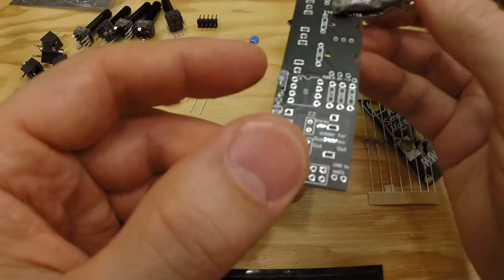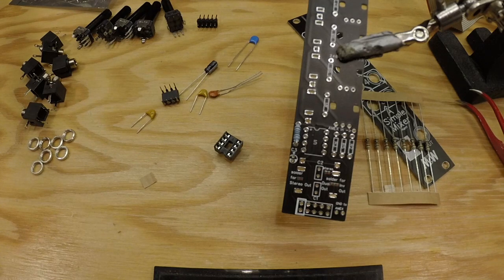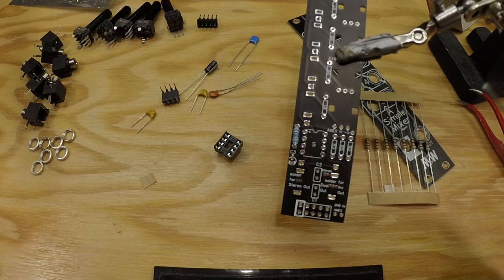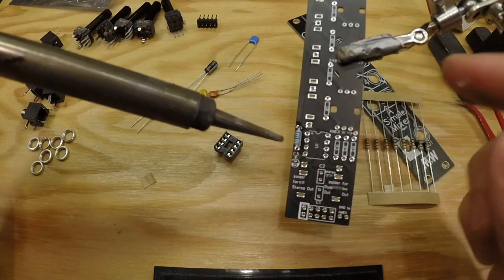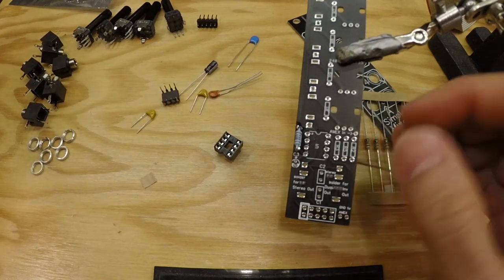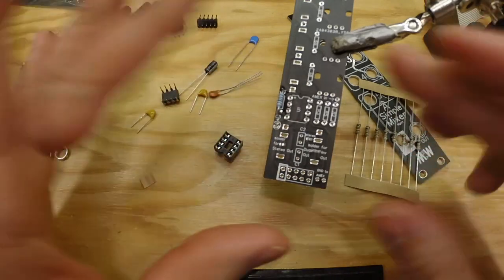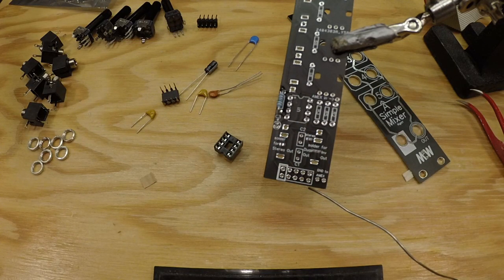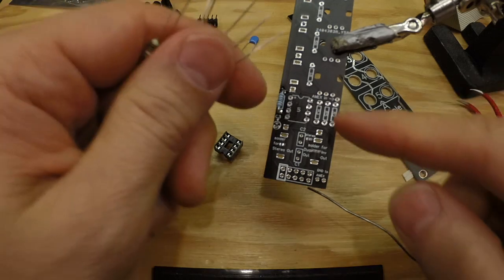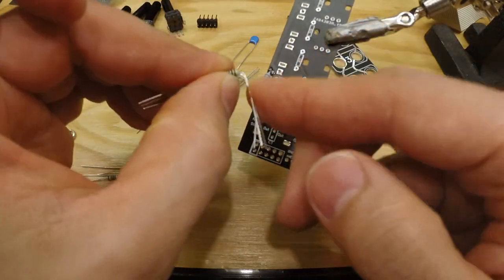Now, one of these helping hands is good to have in these circumstances. I'm also going to turn on the fan, so there will be a slight background noise. And all the resistors also need to be a bit slanted to be able to fit, and it's a tight fit, and that's just the way this one works. So that's the 100 ohm in place, and now we can take all these 10K ohms and just put them in all the other R sockets.